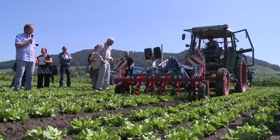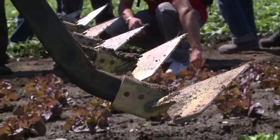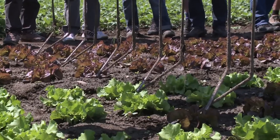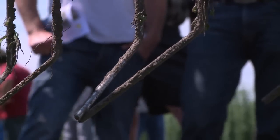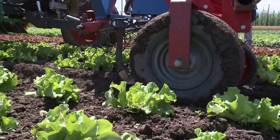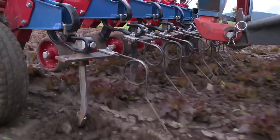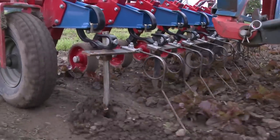A standard toolbar with a frame and parallelograms holds the implements. The torsion weeder can be combined with a blade cultivator. Torsion weeders are mounted on individual parallelograms; they have tines like those of a rotary tedder which converge to form a V and move through the lettuce. Due to spring tension the tines open and close as they touch the plants. The lettuce needs to be fairly well established, however, as cultivating only two to three days after setting would uproot young plants. This technology is useful for weed control in well-established crops such as beans or lettuce.